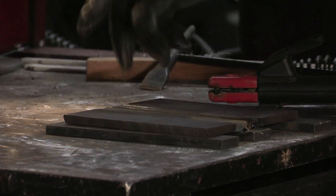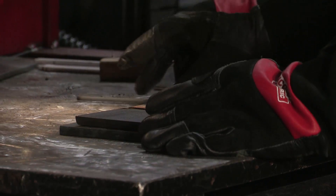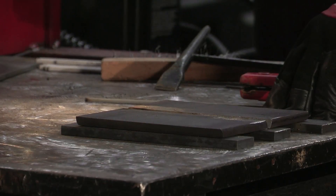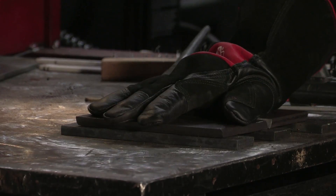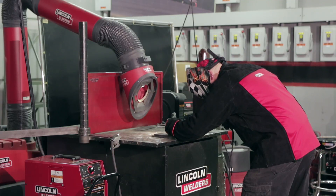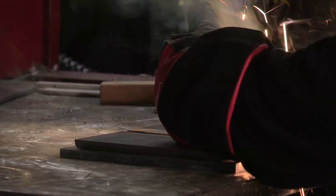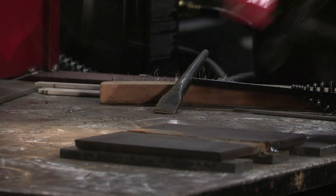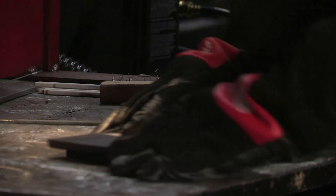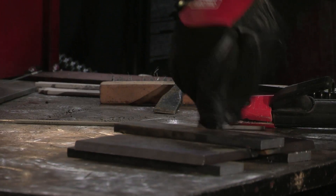After I tack I can still check this other side. What I usually do is pick the plate up, spin it 180 degrees, and if I need to I can tighten this up a little or spread it to get that adjustment. It actually didn't move very much at all so I'm going to go with two more tacks right here. I'm going to turn this piece over and put one more tack on the back right in the middle.